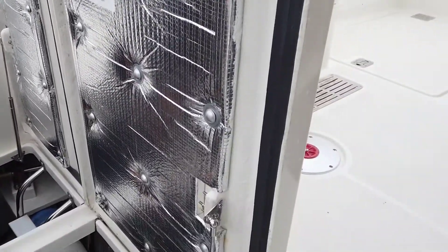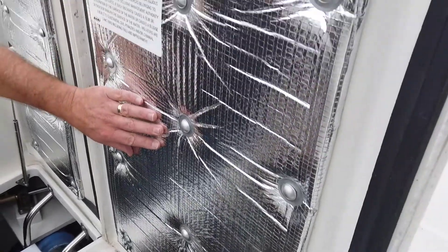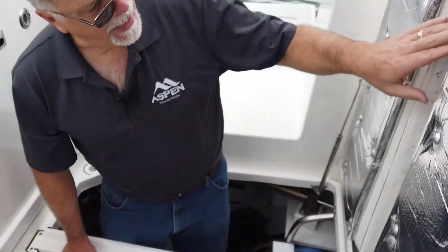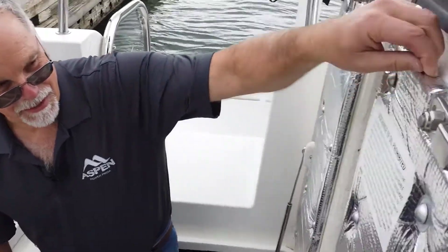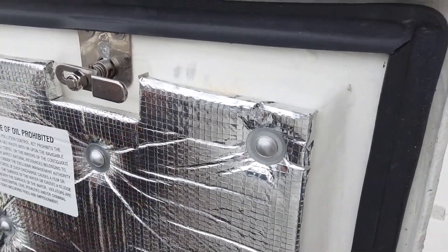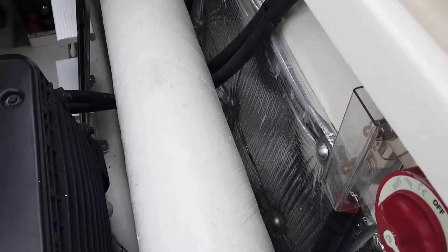See the blue bellows on the muffler? That provides vibration dampening so you don't carry vibration from the engine back into the boat. Look at this flat floor — you can actually stand on a flat surface, which seems normal but a lot of boats don't do that. I'm standing on a nice flat surface with super access to everything in the engine room. Notice the sound deadening — it has a vinyl lead layer inside so the sound gets trapped.